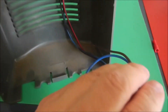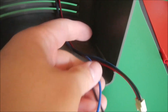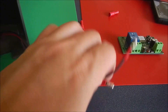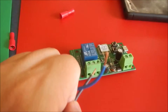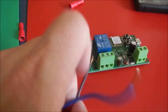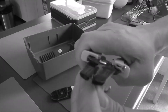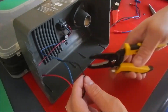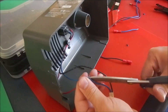I tap the blue and black wires — that means they are in parallel. On the other end of this cable I will connect to the normal open terminal on the Wi-Fi relay unit.